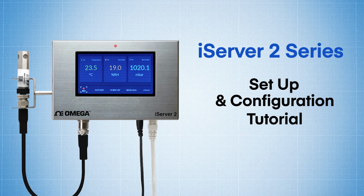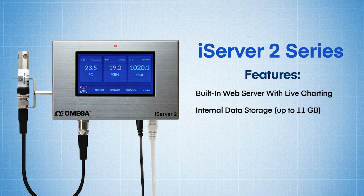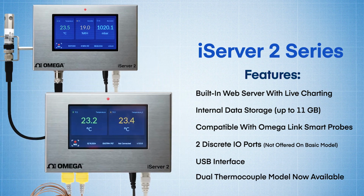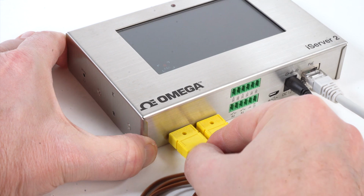The iServer 2 is way more than a chart recorder. It features an intuitive built-in web server with live charting that you can access from any web browser, internal data storage so you don't have to worry about losing your data if it goes offline for any reason, modular compatibility with Omega Link smart probes in a wide array of sensor types, 2 configurable discrete I/O ports that can drive relays, alarms, or switches, a USB interface for easy local configuration and data extraction, and the Dual Thermocouple model offers fast, high-accuracy temperature readings from its 2 built-in thermocouple ports.